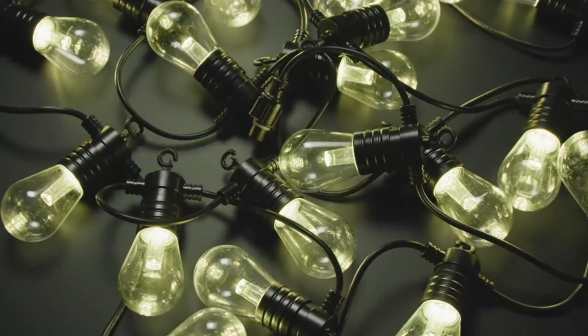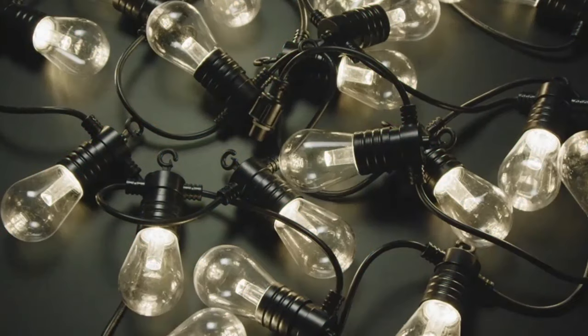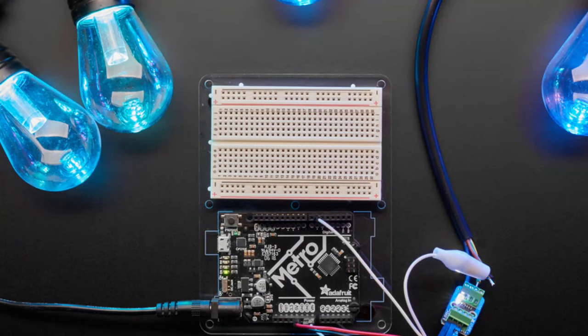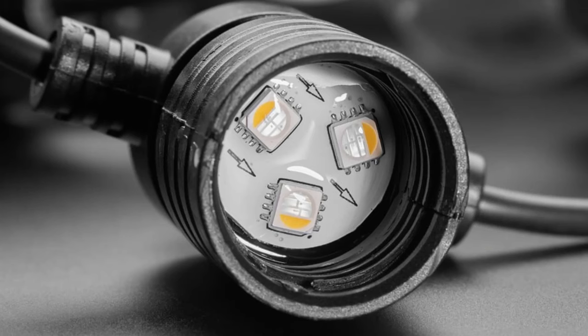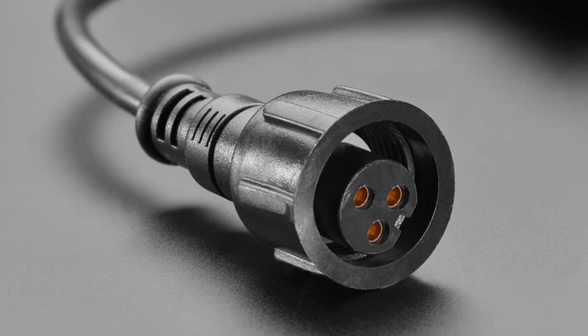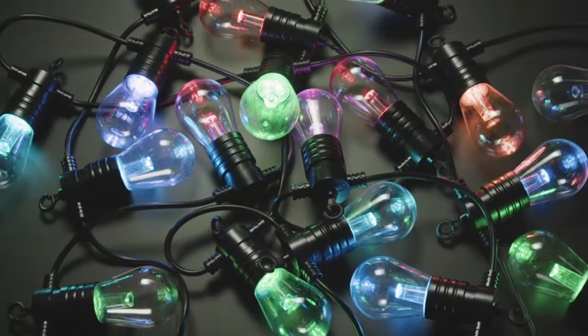We don't specifically have a library for it, but we will have some example code. It's an inverted NeoPixel signal. You might want to pick up one of our NeoPixel smart pixel shifters and inverters, because that way you might be able to use NeoPixel code and adapt it. We'll write in the tutorial how to do it. But basically, these are cool because they have warm white LED ability, so they have a really nice warm light. But the problem is that you can't use just standard NeoPixel WS28XXX code with them. So honestly, if you don't need that warm white LED, just get the normal NeoPixel ones. They work totally fine.